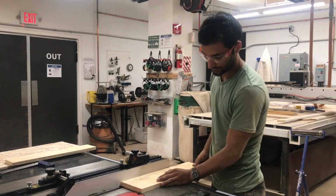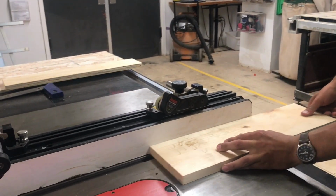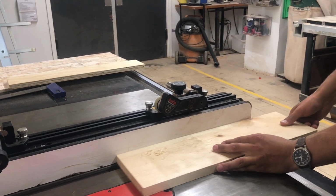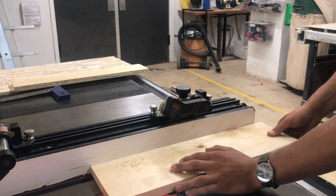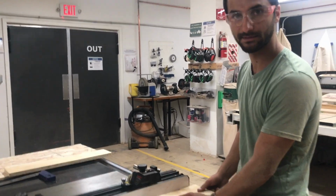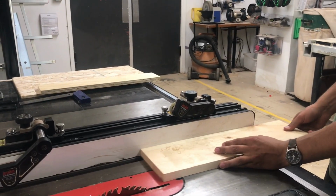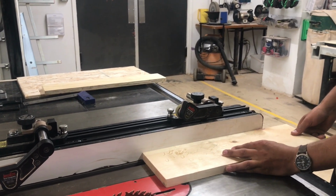So your left hand is staying planted here, it's holding down and pushing into the fence. And your right hand is pushing. So this is uncomfortable for a lot of people. People tend to spider their hands forward or inch their hands forward, and we're just going to put the kibosh on that. Your hand stays absolutely firmly fixed. You're not going to get a splinter. If you do, that's a small price to pay. And you're just pushing down and inwards.